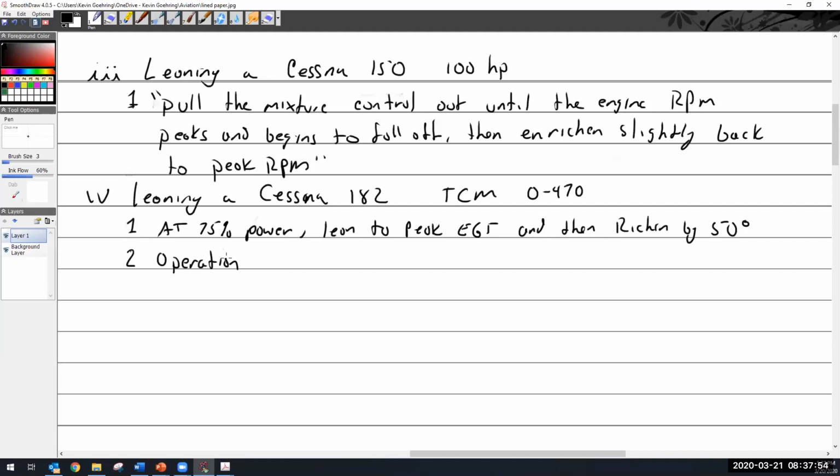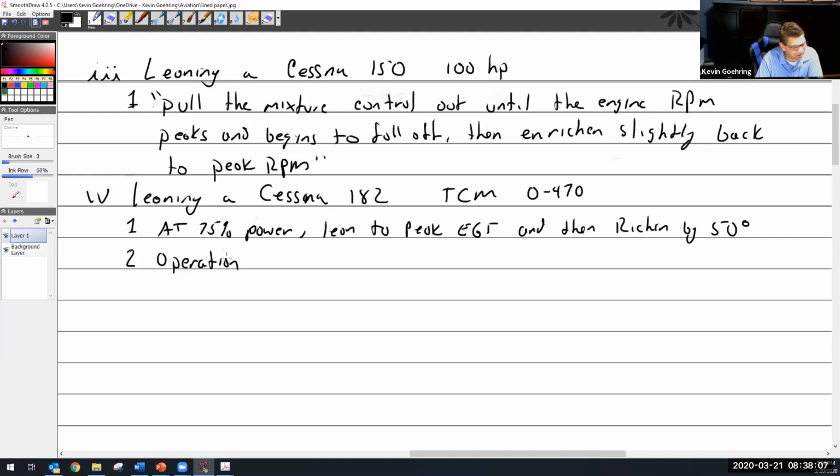Well, I'm going to get to that, number 3. And number 2, I'm going to waste fuel. I'm going to get more lead deposits in the engine because of all the fuel going there. I don't need it. I could foul out; I get lead fouling in my plugs. Although they do okay. It's probably not going to happen because you're at a high temp and it's going to burn off all that lead we talked about. But I'm really losing power. Even though I've got my settings on my gauges, my RPM, wide open throttle, I'm not getting the maximum power out of wide open throttle. It's just wide open, and maybe it's running at 2,500 RPM or 2,400. But if I could lean it, I'm actually going to see my RPM go up and regain more power.